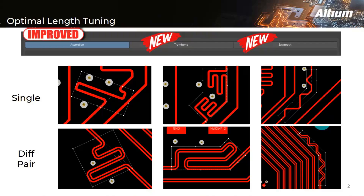If you are working with low speed or lower frequency signals, you can get away with trombone tuning. You will notice that there are multiple 90 and 180 degree bends — it's preferable to use a mitered right angle as it creates a smaller impedance discontinuity. There are a number of different movement behaviors available depending on where you click and hold on the sleeve. The sawtooth tuning uses a simpler polygonal area within which the pattern is built, using no arc bends along the trace. These dimensions are used to minimize impedance discontinuities. There are places where building with an accordion is almost impossible due to the large number of objects near the trace.